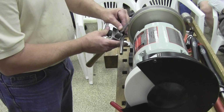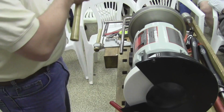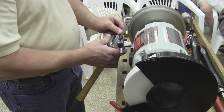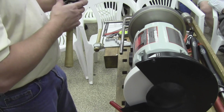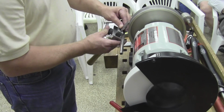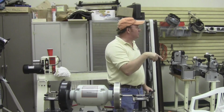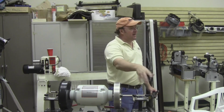Like I said, this just holds it in place. It does get hot if you do it enough, but it's not nearly as hot as a vitrified abrasive wheel. That will get hot enough to turn the tip of the tool. I wouldn't suggest trying it, but if you held it in one spot long enough, you could probably do it. The other thing with CBN is you should not grind carbon steel on it, because that loads the wheel as well. So it's really only for high-speed steel or the high vanadium content steels.